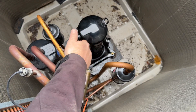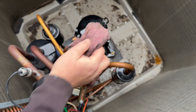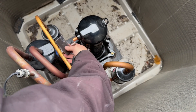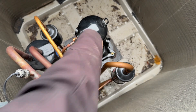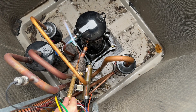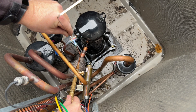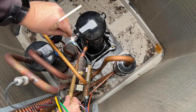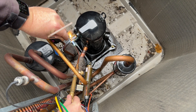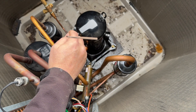I'm going to wipe down the ends of the pipe with a damp rag to get some of that black stuff off. Then I'm going to sand the joints just a little bit - I want to get these joints as clean as possible. I like to hit the heat from the bottom and let the solder follow the heat to the bottom. Since I can usually never get to the bottom, I just let the torch flow that way so it'll fill in the bottom. I'll do the other side just for good measure.